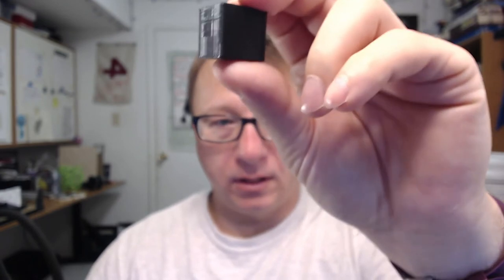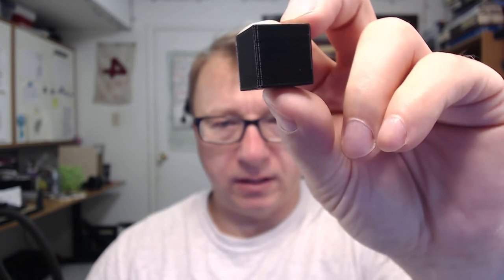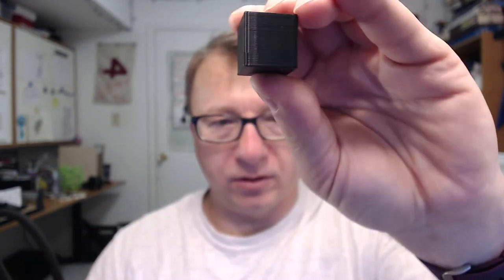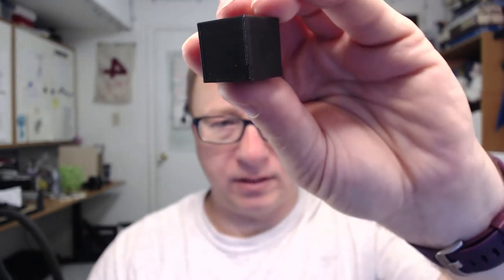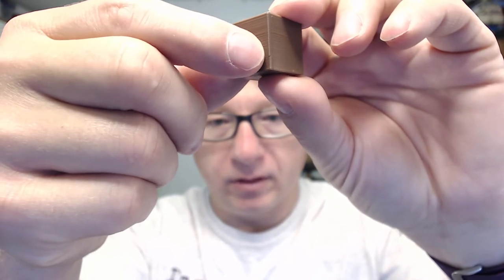With the coast and wipe on, you will see on this corner, just like the other one, this little line on the side here. Rather than it just going partially up the side, you can see it goes all the way up. That is, I believe, where the printer is retracting or moving to the next layer. So this is with coast on and wipe on. The suggestion was the zitting would be removed with coast and wipe turned on. You can see there is no zitting, but there is this line, which I believe is where the retraction is.